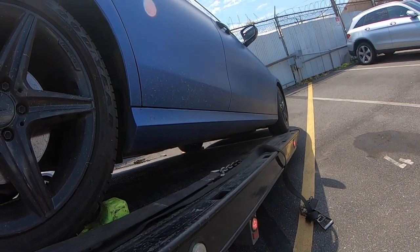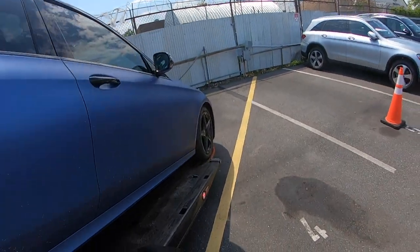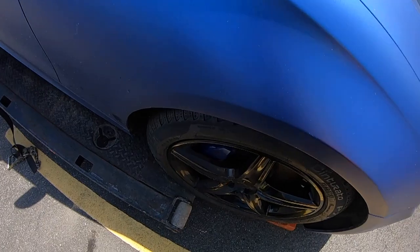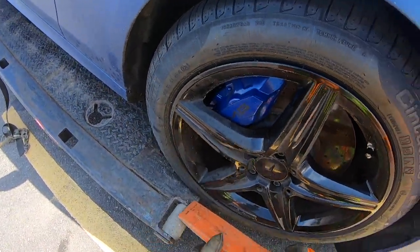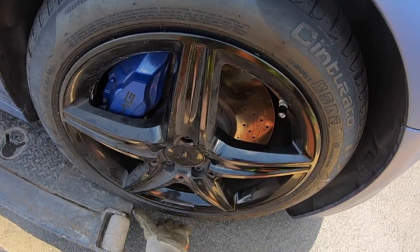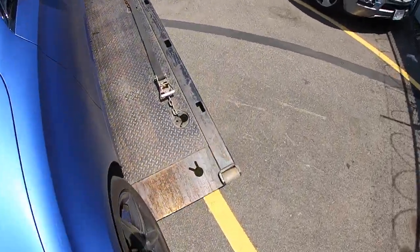Come on, skate, come out. That's two. All right, so I put the skates like this, right? Now I got the winch up there. So now we want it so that the skate, when it gets here, it pops out. Now when I drop the car down, the tire will be on the ground. I can pull the bed up. I'll leave the back skates. So that's how I always do these.